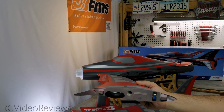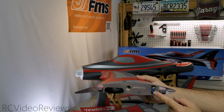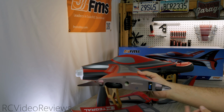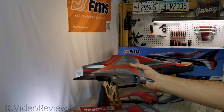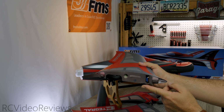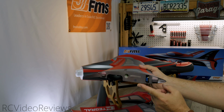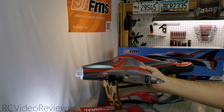And then on the wingtip, they use these metal 9-pin D-shell connectors, and I like those a great deal because they really simplify assembly if you want to take the wings off at the field. So if you want to take them off to transport the plane, this makes the job a lot easier because you don't have to worry about polarity and which wire goes into which. I really like seeing this upgrade. Two thumbs up for me on that.